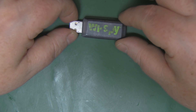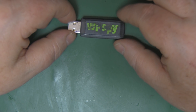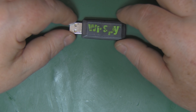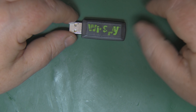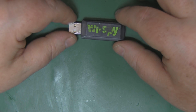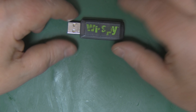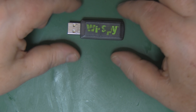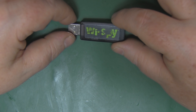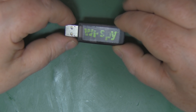It's pricey, but you're paying for the software. It's a useful tool if you can get hold of one cheaply - it shows all the noise and activity on the 2.4 gigahertz spectrum, channel by channel. You can work out from the pattern whether it's a wireless network or a 2.4 gigahertz camera. It's really useful for FPV to see how your transmitter is actually transmitting in real time, and for doing a site survey to set your router to its optimal settings.